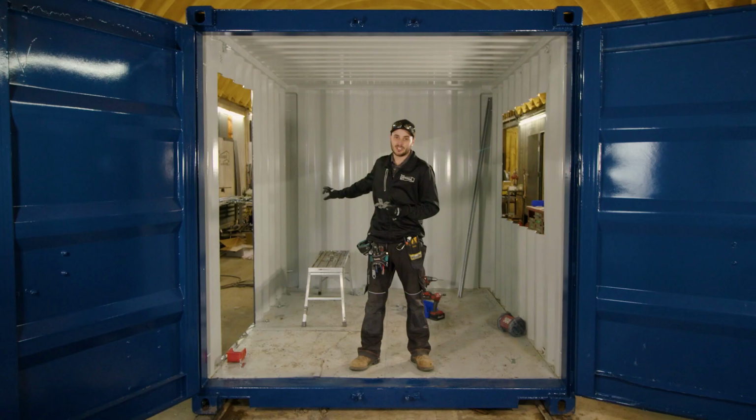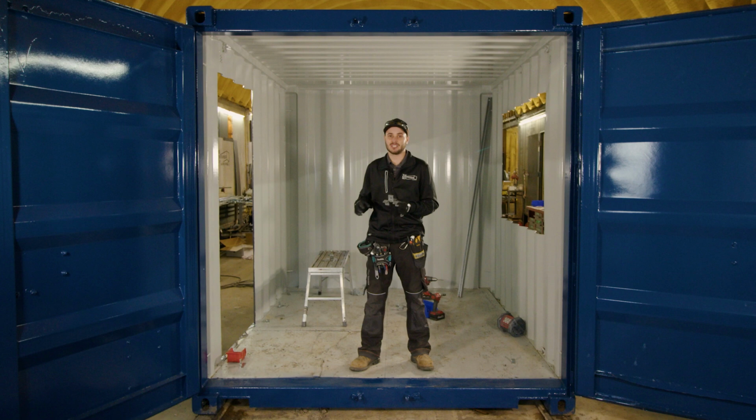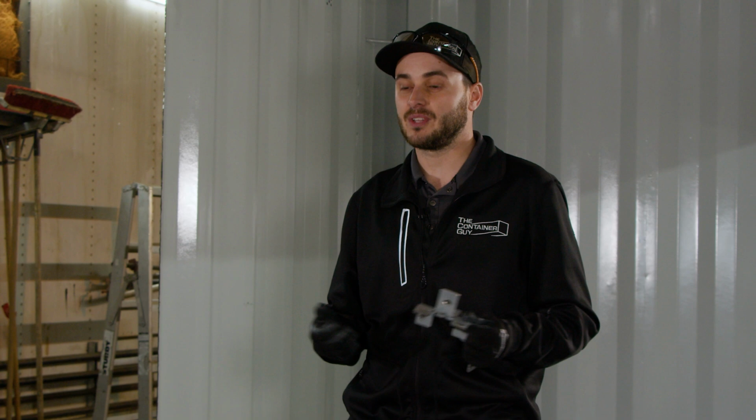What we're going to do next is strut line the interior, and we're strut lining it for the purpose of putting horizontal 2x6 treated boards as slats. It's a decorative thing, but also the customer is going to be able to mount their TV and electrical to this, so they'll have freedom and flexibility of just using regular wood screws to mount whatever they want inside this thing.